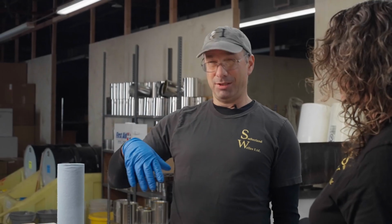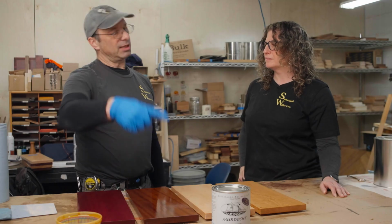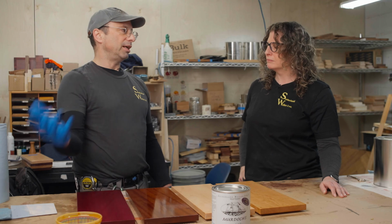You want to make sure you're in a dust-free environment. You want to make sure you're between 55 degrees and 85 degrees, and under 65% relative humidity. All those things are really important. If you wanted this to cure faster, what I would do is leave it for about an hour, and then come back in here and turn on a fan. That fan is going to help push oxygen on top of it, which is going to help it cure. Okay. So yeah, best of luck.